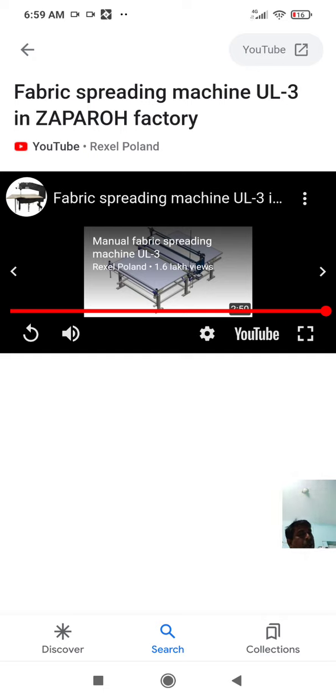Narrow fabric, resulting in garment parts at the edge of the lay being cut with bits missing. Incorrect tension of plies, resulting in fabric spread too tight or too loose, causing parts not to fit in sewing and finished garments not to meet size tolerances. Plies not all facing in the correct direction. That is, not all the plies are spread face down, face up, or face to face as required. Mismatching of checks. Parts not fully included due to splicing errors. Spread distorted by attraction or repulsion of plies caused by static.